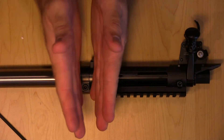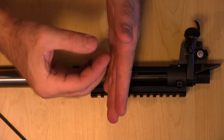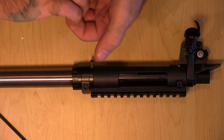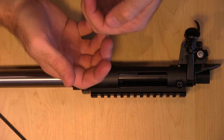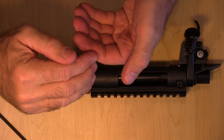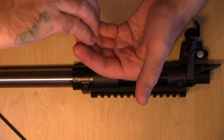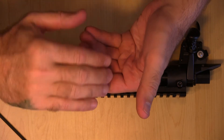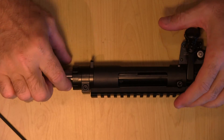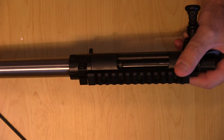All that force closes this and pushes the barrel this way because it's locked into the threads. As it closes, it pulls the barrel's threads against, locking it. Whereas when you torque a barrel on, part of the torque is overcoming friction of the threads sliding against each other — potentially galling, ruining, and stripping it. With the bar lock, you tighten it down without that friction, just applying pressure against the threads as the barrel is pulled out.